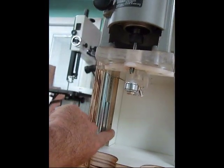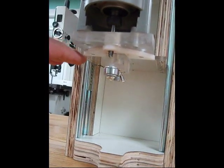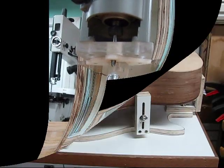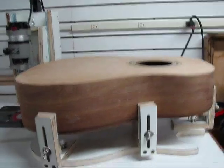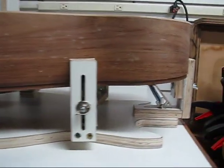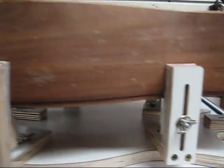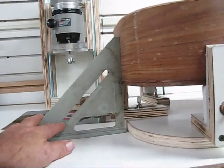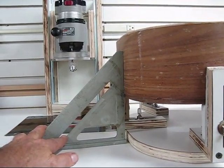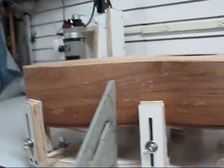I also have a little piece of wood here that comes in and out — it's just a shim to keep the router from falling all the way down; it's pretty much up to where I need to route. The next step is to place the guitar into the cradle. It's just a matter of setting it in there and then putting all the clamps up and tightening them. The most important thing is not to keep the top level, but to have the sides perpendicular — square to the table, which will be square to the router bit. I set it at the waist and at the head block.